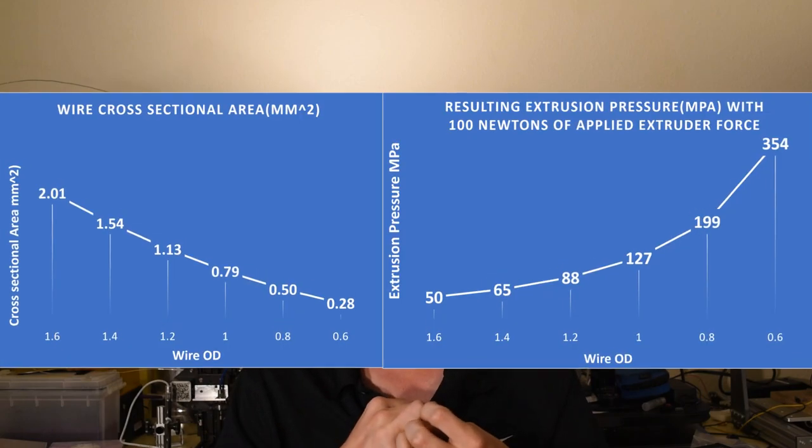So we're working on getting over that by getting the right feeds and speeds and doing a few of our future prospects, one of the most important of which will be shrinking the wire diameter from 1.6 millimeters OD to 1.2 or even 1 millimeter OD, maybe 0.6 or 0.8. We've had some good suggestions by Junkers and a few other people in the Discord on that. If we can figure out a way to handle wire that small, we'll definitely want to work with it,